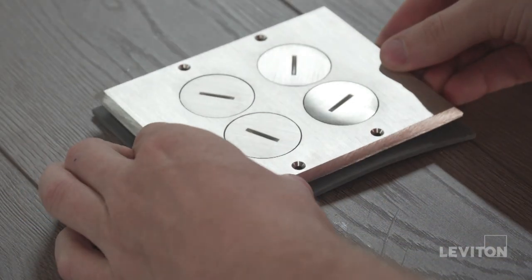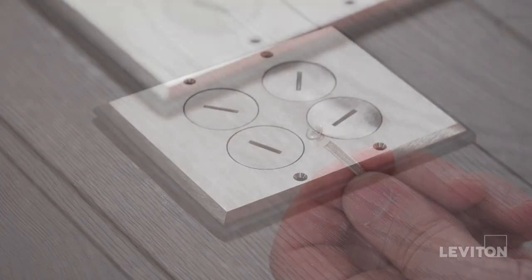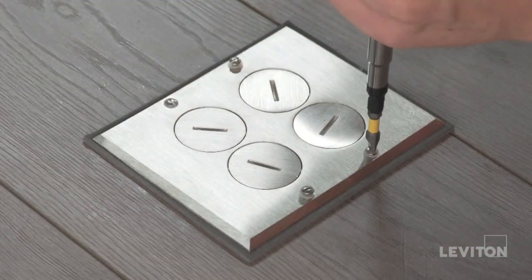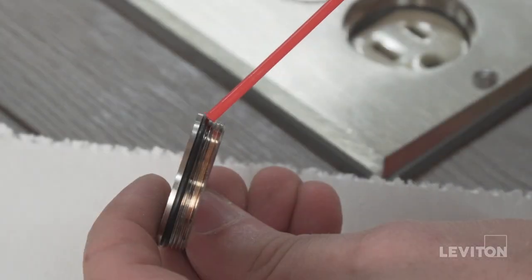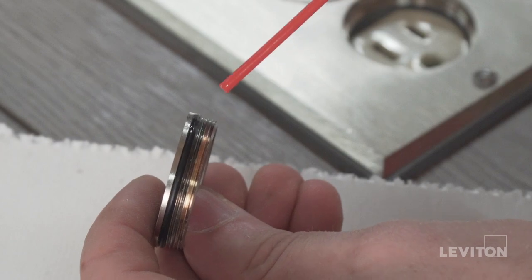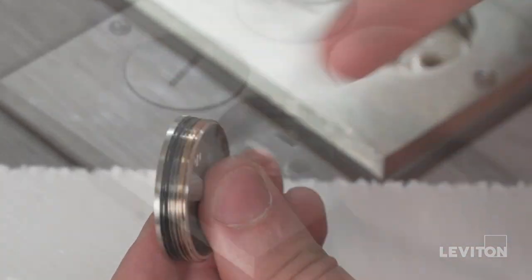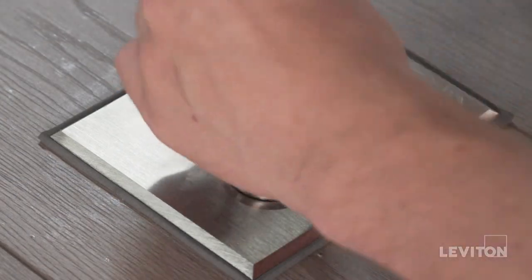It is now time to mount the cover plate. Ensure that the washers are on the cover plate screws and attach the screws to the cover plate using 9 inch-pounds of torque. Do not over torque. Apply an all-purpose silicone lubricant to the O-rings on the screw caps before assembly. Attach the screw caps using 20 inch-pounds of torque. Again, do not over torque.